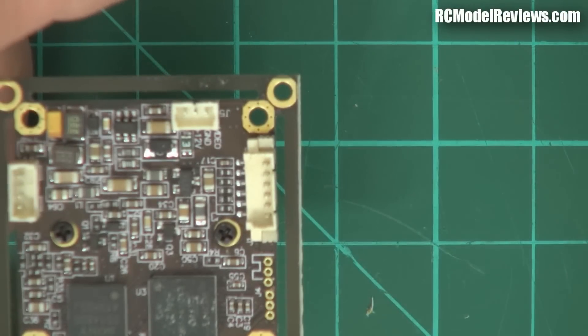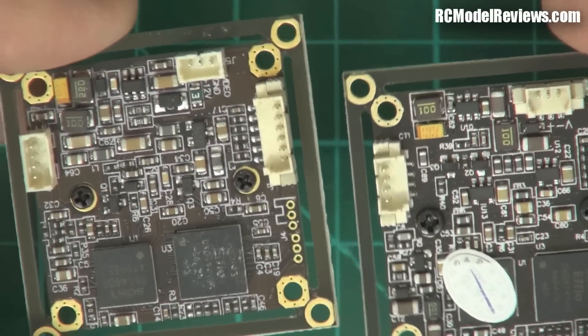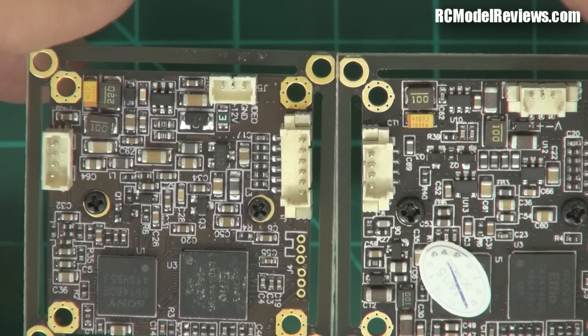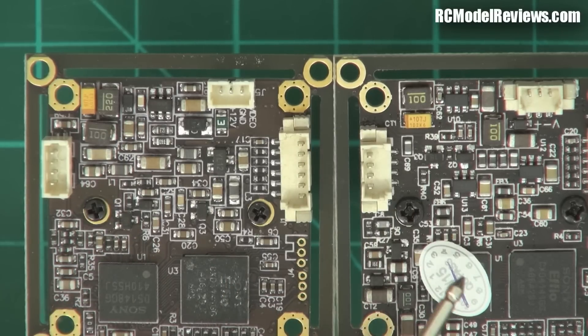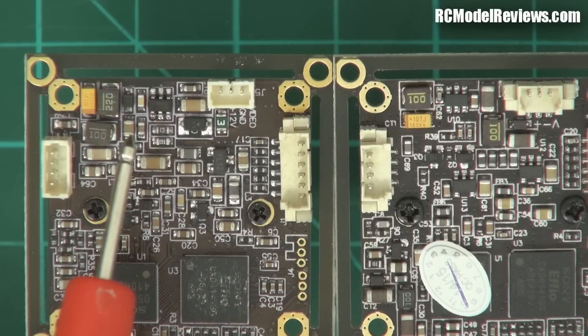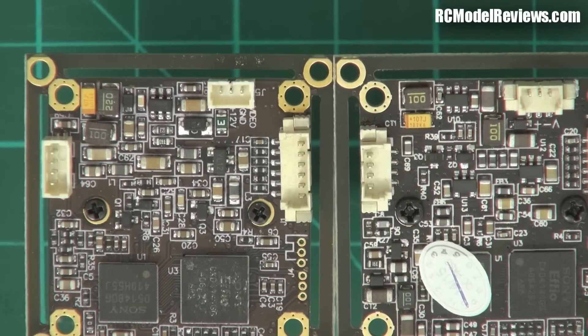So what did they change between the two versions? Comparing the circuitry on the two boards, you can see the layout has changed slightly, and there's a little inductor on the newer one that doesn't seem to be on the older one. I think this is the power supply circuitry. Most of the UHF noise is probably coming from the switch-mode power supplies that take the 12 volts input and step it down to the much lower voltages — typically around 1.7 and 2.7 volts — that these chips require. If the old power supply was creating noise, they've modified it to reduce that output.